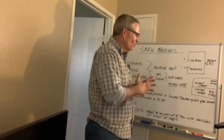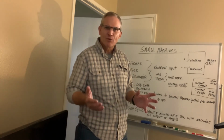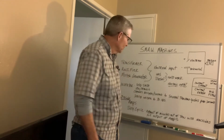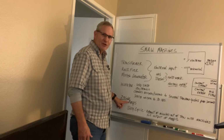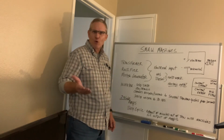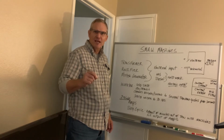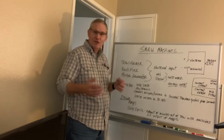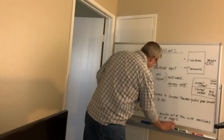I think the whole reason why I do this lecture is for people to take these two items into consideration when you're going to buy a welding machine. One is the amps, the amount of amps that you're going to run. So you wouldn't want to buy a 120 amp machine if you want to run 1/8 inch 7018 electrode. Now 7018 happens to be the electrode that we're going to be welding with on Tuesday.